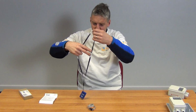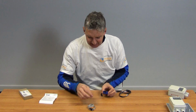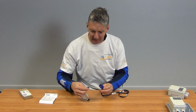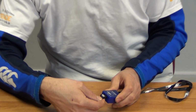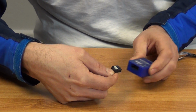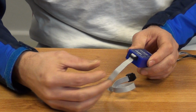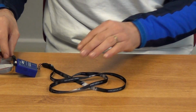If we look at the base of this meter, we'll see that we have 8 pins here, and if we look at the cable that's to go in here, we'll see there's 8 slots in it. There's a little groove on top which marries exactly with this groove here. So there's only one way of successfully inserting this, and I'll just show it. Probably a little bit hard to focus in on, but you can see the general effect. In it goes like that. So it's pretty simple.